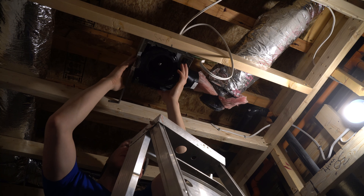If you're doing this into drywall right now, make sure that you flip the tab and put it on. If you're going right up to drywall, you'd use this one, because that would sit flat into the drywall ceiling. The other way you could do this is if you slid this into the hole by grabbing onto the fan assembly — you could flip these down. If you've got long enough screws in the drywall, you put the screw through the drywall and into this anchor right here and it'll tighten that against the drywall. Make sure you put a washer on it.